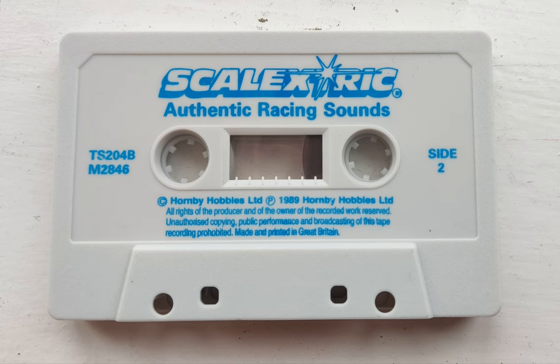Great. Now, how do you know which way round they should go? Well, if the connectors are both connected the same way, then both the cars will go in the same direction. Ah, yes, I see. Now, the next thing is to connect the trailing wires that come off the red connector and out of the bottom of each throttle to the power unit. That's a red wire from each throttle and a black wire from each connector. Now, on the power unit, we've got two silver screw terminals. Right. Now, you have to unscrew these completely.